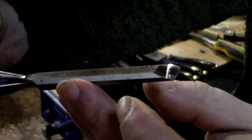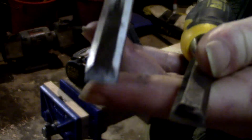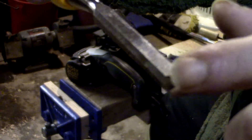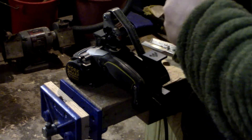Every chisel I get — cheap or high-end — I take some time to camber the edges of my blades. Notice there's no hard corner on the top here. Compare that to a similar-size chisel from my dad — it still has the factory corners on it, very sharp top edges. Mine has a smooth cambered edge. I haven't really changed the profile of the cutting edge itself; I've cambered it so it's a smoother transition and wood chips move fluidly. The factory ground edge on hardware store chisels is pretty rough, to say the least.